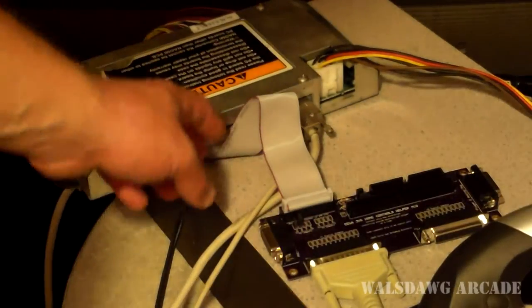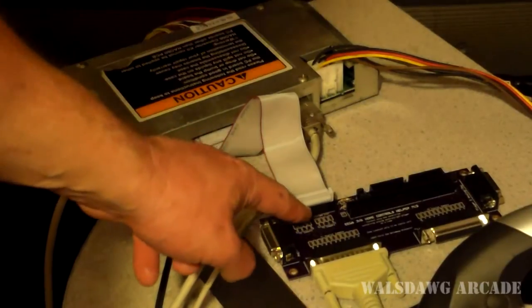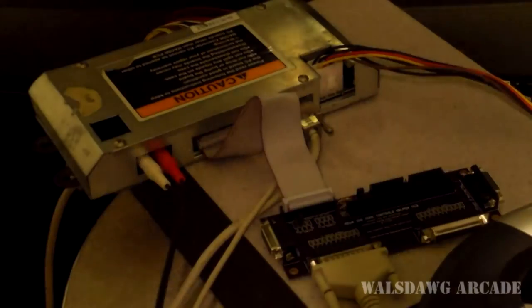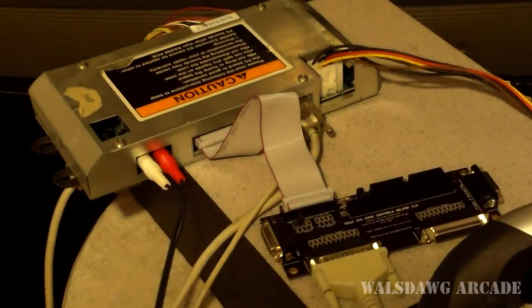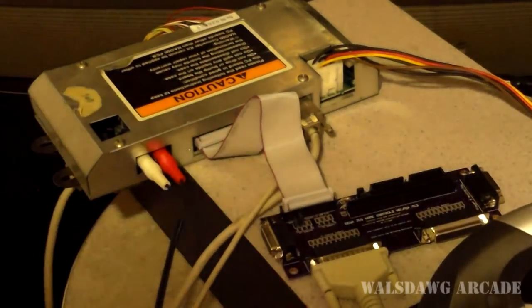And then I've also got this connected via the 26-pin cable to the analog port on my PCB and into the back of the Capcom IO. I know most people have never used that port, but when you use my PCB, you can play racing games such as that with the Naomi. Some games on Naomi require a higher revision of the IO, and the Capcom one won't work with those games. In that case, you could just use one of the other standard JVS IOs.